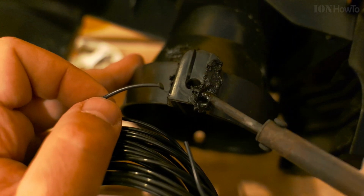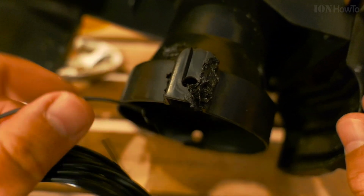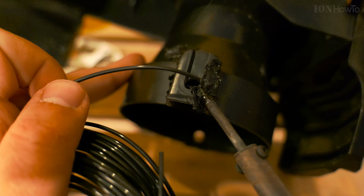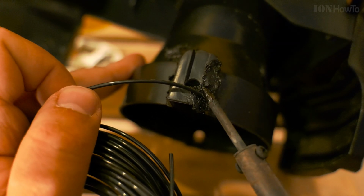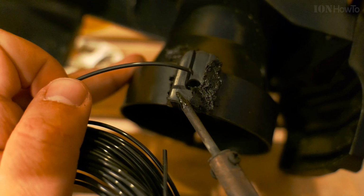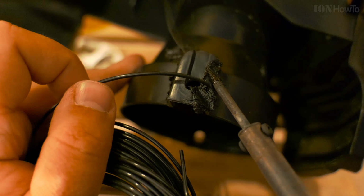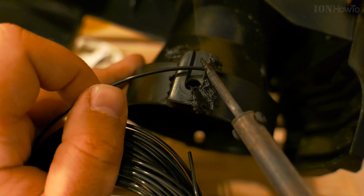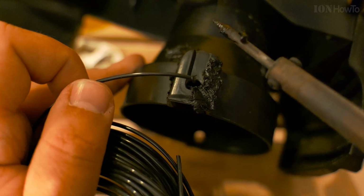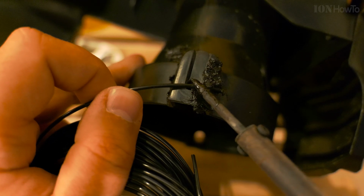Only a filler material of plastic is really good enough, but if you want it to be extra strong, you can use a paper clip inside to actually fuse it into the plastic after you do this. So you do this and then you can add a piece of metal. Really, any stainless steel is the best to use. If you need it to be extra strong, you can use the plastic welding machine, but the cheapest really is to use the soldering iron, and you can use the paper clips or any piece of metal, and it's better if it has an irregular shape, not straight, so it grips more on the plastic inside.